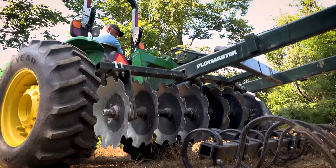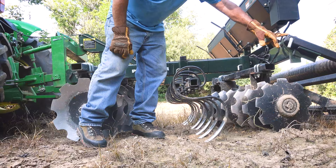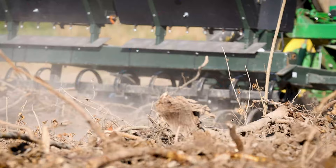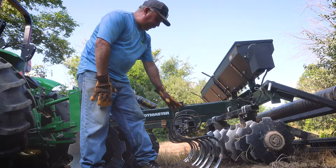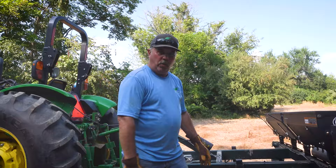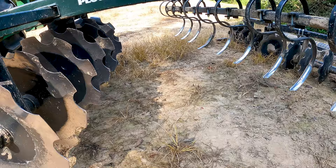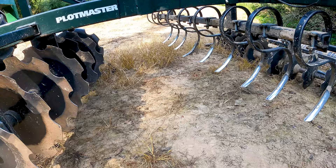What I'm going to do is take these S tines, drop the disc blades off the back, move these S tines to the very back, and drop my cold packer and my drag screen off the back, and use this more as a root rake. Now this comes with three or four S tines in it — this is an eight footer. I've added four more S tines to give me more area coverage and pick up more brush. I'll pull these pans and show you what it looks like when it's all set up and ready to go as a root rake.